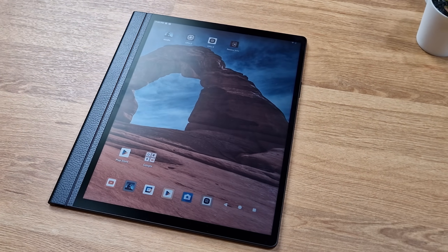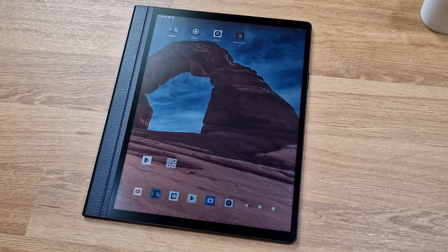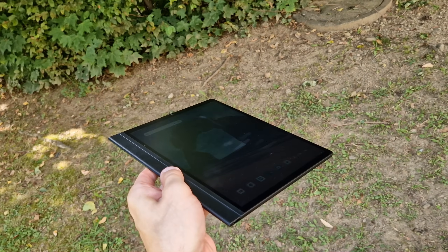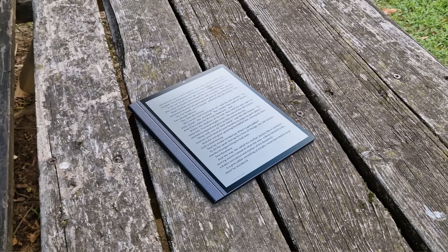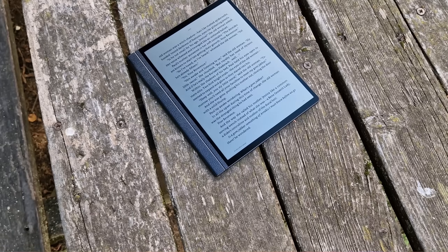And that brings us to the second downside, which is how R-LCDs reflect light. From my perspective I can see the screen's contents easily in this setup, but from your perspective the screen just looks very dark. That's because it's not just about the reflectance, but also about how light is diffused. Because e-ink diffuses light omnidirectionally, it's much less susceptible to different viewing angles than a reflective LCD — the reflected light on an R-LCD is more directed and not diffused in every direction. That's why it's important to have a generally bright environment with an R-LCD rather than just a single pointed light source, and why you might need to adjust the tilt to get optimal results.